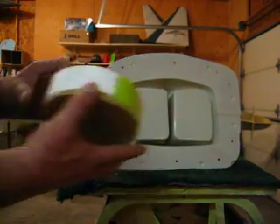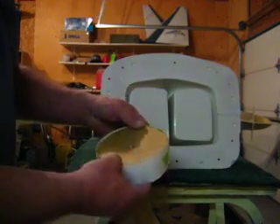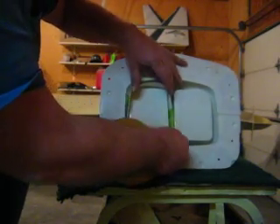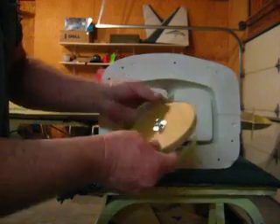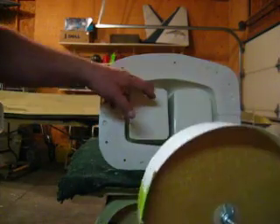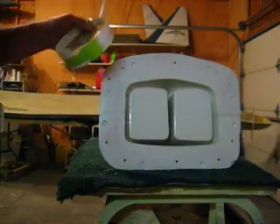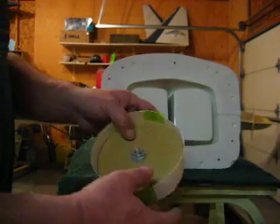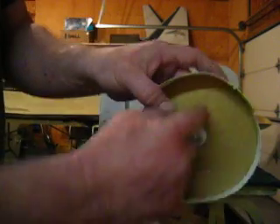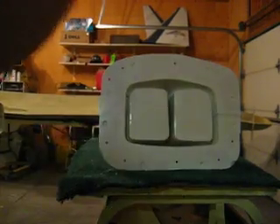My ductwork — that's going to be easy, I figured that out. It basically just has to go from square to round. I took this piece of paper and it fits around there, then I figured out how big to make that circle, so it'll be about that long. What I'll do is lay up just a piece of glass on a piece of Formica, get a square sheet and roll it around this to make it round — just one layer so I can really work it. Then I'll stick it on there, and wrap a couple layers of carbon fiber around it to keep it from collapsing. Nice easy ductwork.